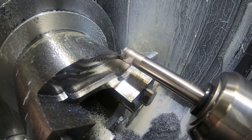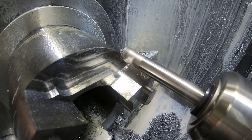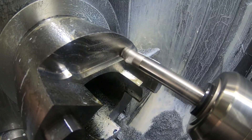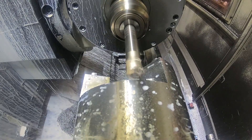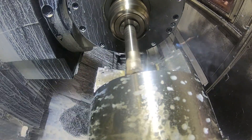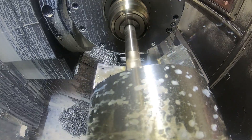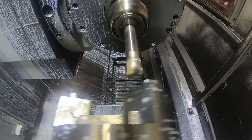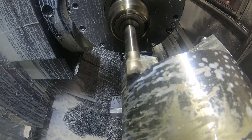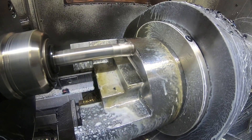I'm being very conservative with the feed and speed right now because I just didn't want to worry about anything on this machining of this fixture end. But when I normally run a tool like this in steel or stainless, this tool is running about 60 inches a minute feed rate right now, but I would normally run maybe 90 or 120 inches per minute and maybe a little bit higher RPM. I've experimented with different ways to rough material, and using feed mills is the fastest way I've found. If you use bigger ones like a 3-inch diameter on a shell mill shank, you can rough off a lot of volume of material very quickly, and it's very reliable.